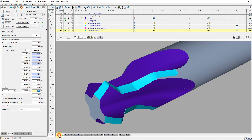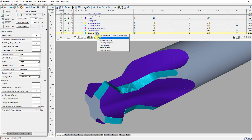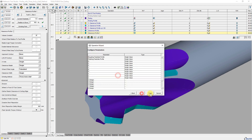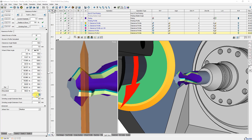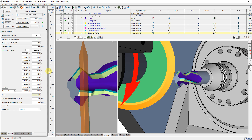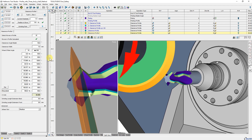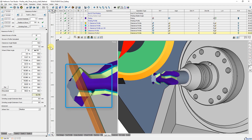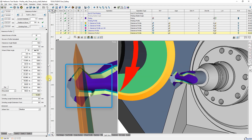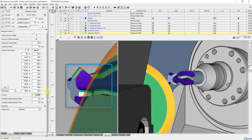Now I add a second clearance angle by copying, reconfiguring, and adjusting the operation — such as clearance angle and grinding length extension front. With the parameter A axis, the grinding position is rotated around the center of the axis of the workpiece. This changes the position of the grinding wheel to the cutting edge and the traverse movements of the individual axes. This offers an additional possibility to influence the course of the clearance angle.